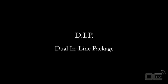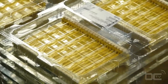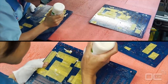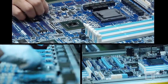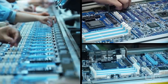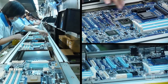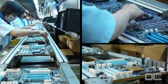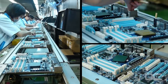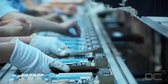Once these last tests are made after the SMT, it's time to go to the DIP, or Dual Inline Package — the second big important process in making a motherboard. First comes manual insertion: all the small components and chipsets have already been added, and now it's time to place all other components that have pins going through the PCB. You can see a long line of employees inserting the I/O connectors, power plugs, PCI Express and RAM slots, as well as chokes and solid capacitors around the CPU socket. Each inserted part needs to be in the right place and well positioned before wave soldering.